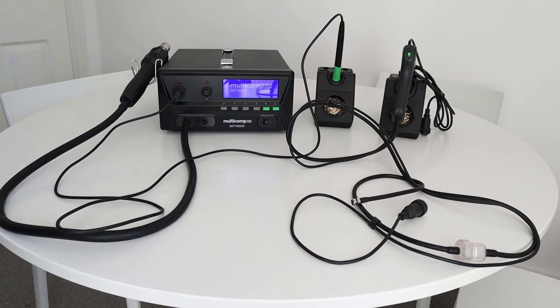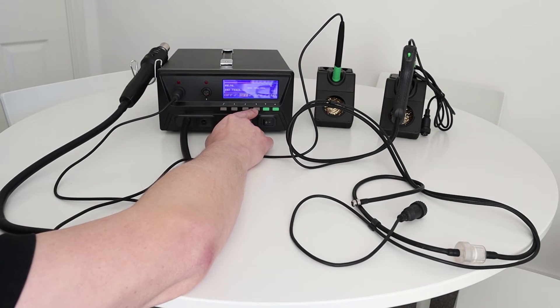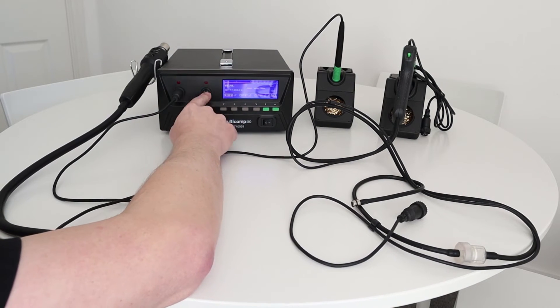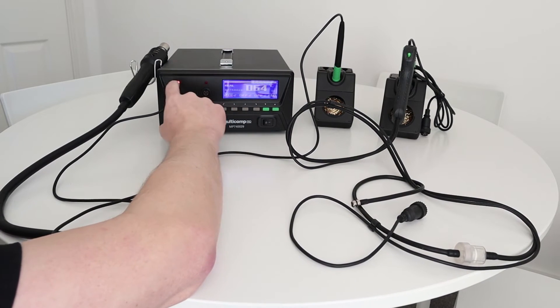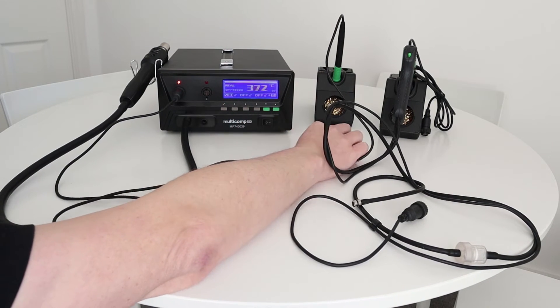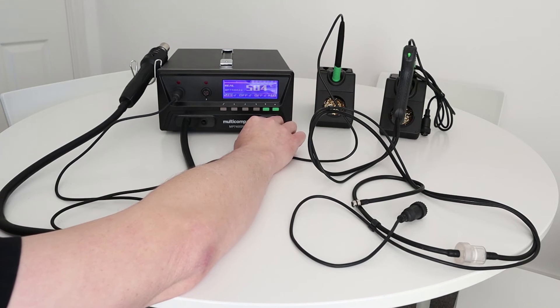Let's turn it on — the power switch is on the front and it takes a few seconds to boot up. You get a nice display, and the functionality is quite good. The first button switches the suction pump off and on. You have three memory banks, and the unit auto-detects which tool you've plugged into which port. You can switch tools on and off and set the temperature — pushing and holding number one with the soldering iron plugged in turns it on and the red light comes on as it starts raising temperature. Through the green buttons on the right-hand side, you can raise to your desired temperature, all the way up to 500 degrees centigrade.